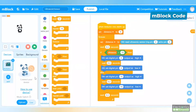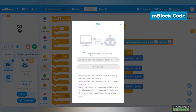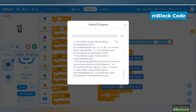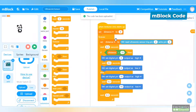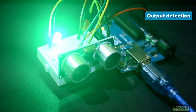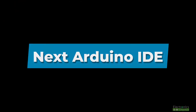Once saved, click Upload and connect your device. Select 'show all connectable devices', hit Connect — it shows as connected — then hit Upload. The upload progress goes from zero to 100. The code is now flashed on the Arduino. You can see the green LED is on when there's no obstacle, and the red LED turns on when an obstacle is within 10 centimeters.